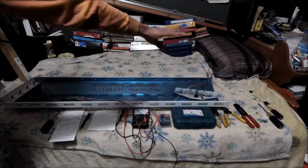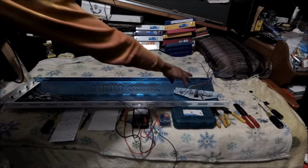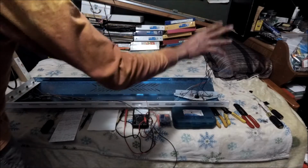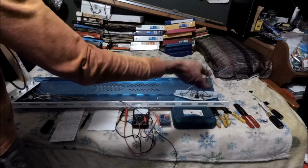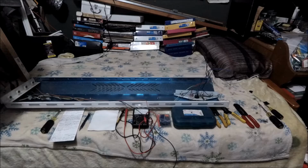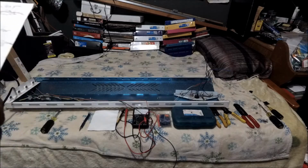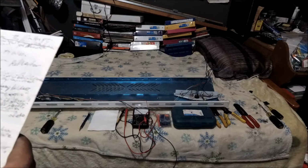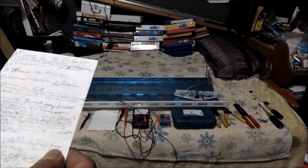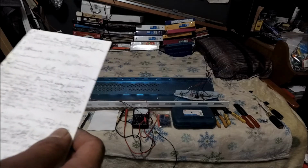This side we're not gonna bother. We're not gonna do anything. We're just gonna rewire this. These tombstones, all of these loose ends, they're gonna get wire capped, meaning just put a wire nut. Alright, so that's step 11, rewire the fixture to the single-ended power. And that's what we're gonna do. That's step 11, and that's the long process, rewiring everything.